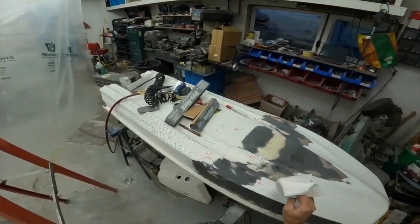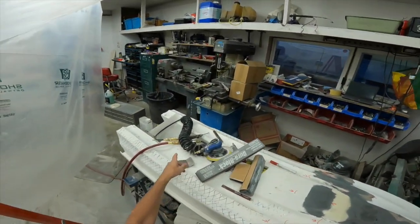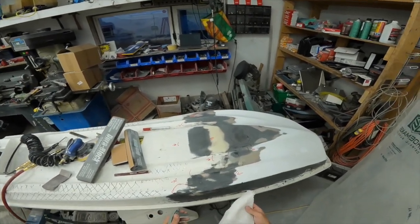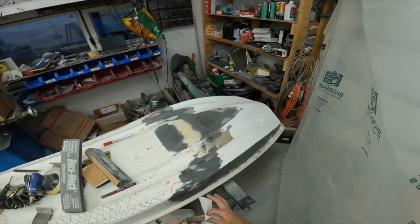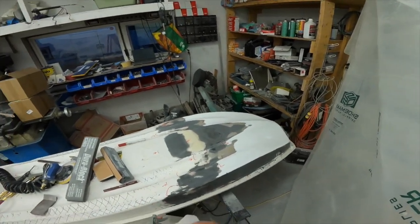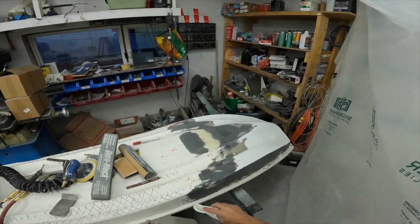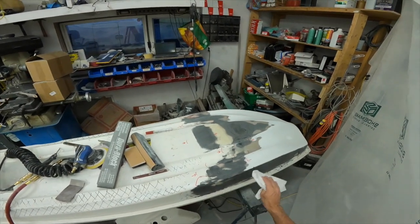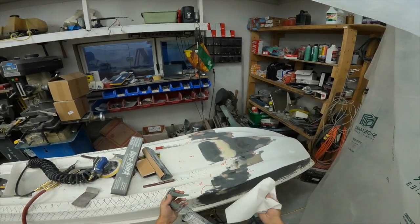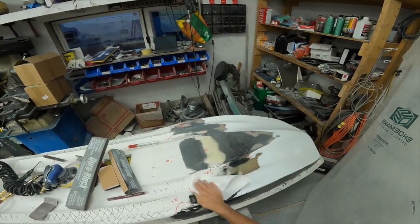You want to make sure that the surface is scuffed up well. So I used a 40 grit sanding pad to do all of the area and then I blew it off with compressed air. Because compressed air, a lot of the time, will have oil in it — mine for sure has a little bit of moisture in it despite all the efforts that I've taken to get the moisture out. So what I like to do is use alcohol as the first step of cleaning. If this was extremely dirty, then I would use soap and water to get it off. But I've blown it off and I want to make sure that there's no moisture left in it when I apply the epoxy. Alcohol is really good at getting rid of moisture because it absorbs the water, and then as it flashes off it takes the water with it. So I'm going to spray it down first with alcohol.